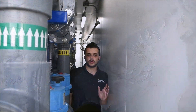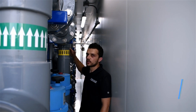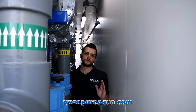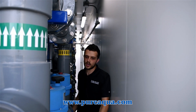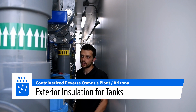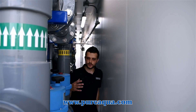A little bit more detail about container one of three: we have our feed and backwash pumps behind me, four multimedia filters which operate in parallel, pre-chlorination injection, and potassium permanganate injection. This plant tolerates feed temperatures between 50°F all the way up to 130°F, so all piping and instrumentation have been designed to accommodate that. We're utilizing CPVC piping, high-temperature lining for the carbon steel tanks, and we've insulated some of the tanks as shown here as well.